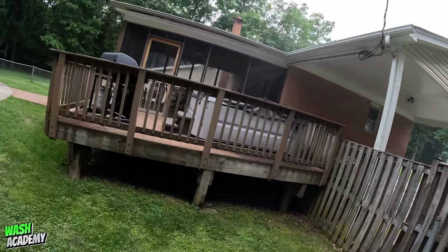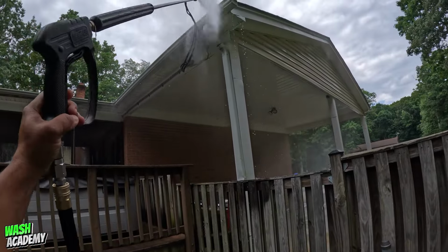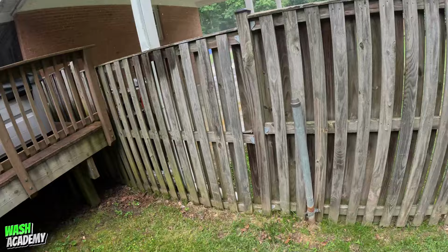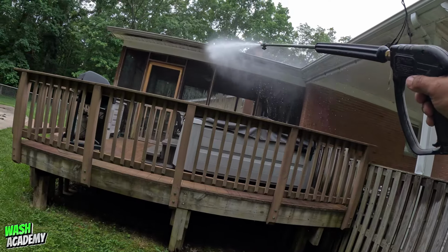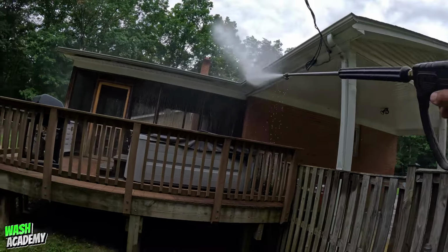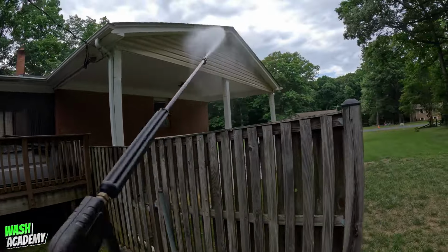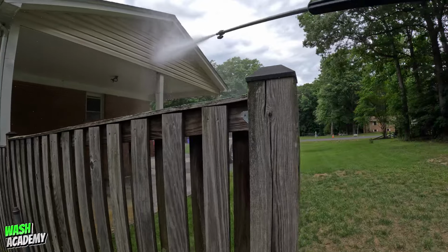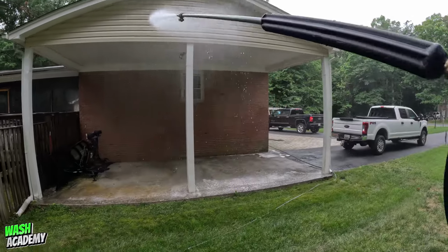Ooh, that's looking pretty good. That solution's already starting to work. And that's what works for me. I'm gonna hit that with my shooter tip. That's what works for me, right? But I know a couple guys that will run their SH straight, even though it's 12.5%, for example. I don't do that. I cut mine because I'm able to maximize the usage, you know what I mean? Because I'm getting 600 gallons and I'm able to milk that a little bit more. I'm not going through so much SH.